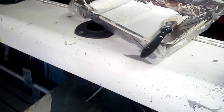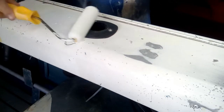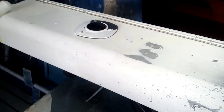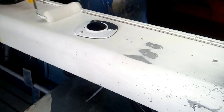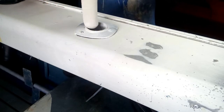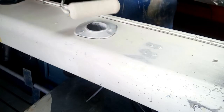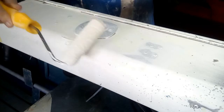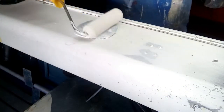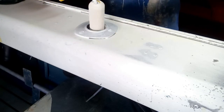You can see all the scratches and gaps around the rod holders, and gaps where the top alloy cast sections are pressed onto the side. I'm going to fill all that and it'll stay like that permanently — it's flexible. Enamel paint is not flexible; it becomes brittle and if you bump it you'll take chips out of it, you'll scratch it. This stuff is very forgiving and flexible. Think of it like a rubber band — you will damage it, but not to the same severity. It's much more resilient.